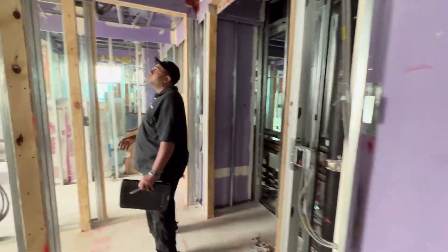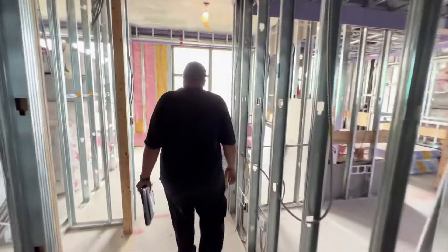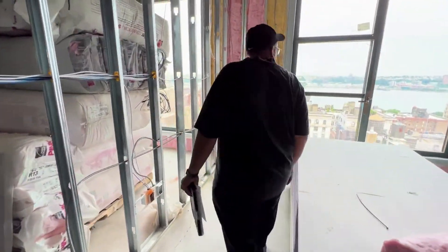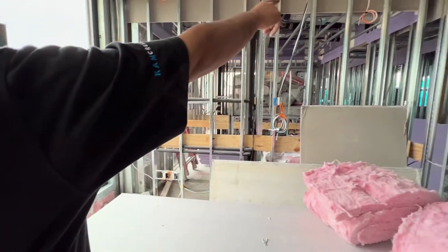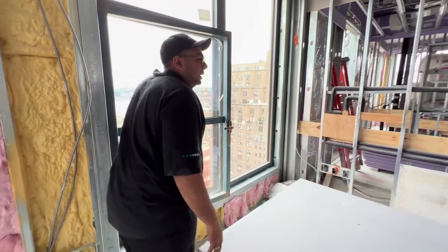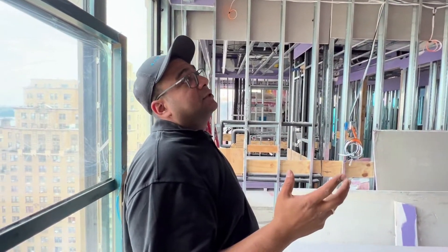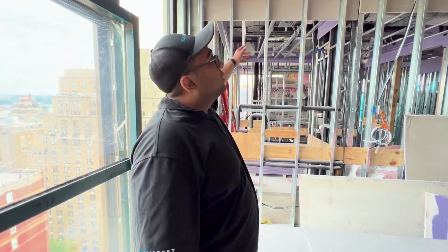This is the second bedroom. I have an access point in this hallway right here. Another low-voltage jack right here. One low-voltage jack right there, and then your TV here. Speaker there, speaker here, and your shade over here. I want to be clear — our plan was calling for ceiling speakers, but this ceiling is not going to have embedded wiring according to what these guys are doing. So the way I've wired it is for in-wall speakers, placed in this cavity.